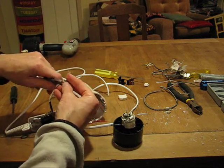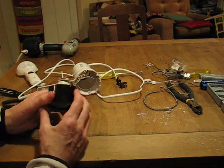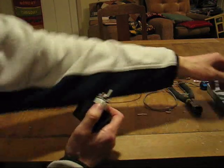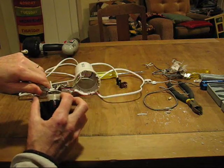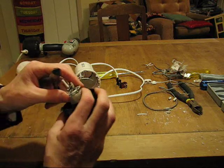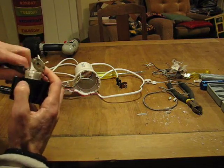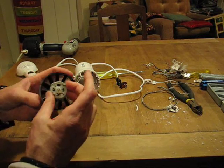We get rid of the remaining loose wires and components. The motor has diodes on it, and in this case some ferrite coils as well — that's an interesting innovation — but sadly we don't want those either, so throw those away. What we want is just access to the two inputs to the motor. And now we're down to just a standard 12 volt motor with two inputs, and we've got a bunch of wires and a nice housing to put it all in.